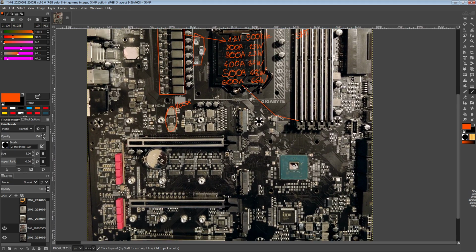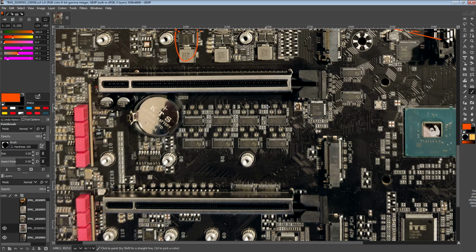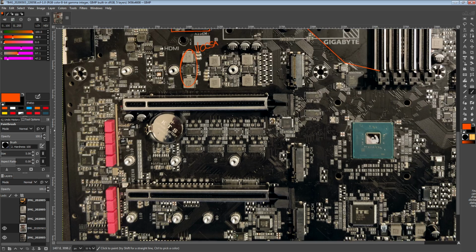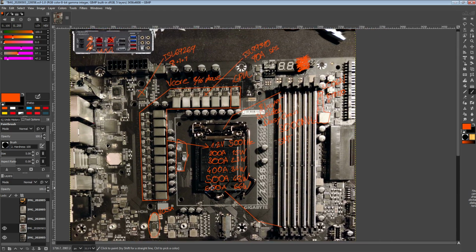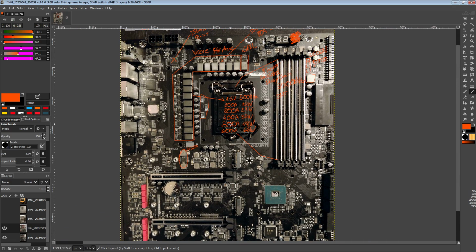But yeah, other than that, I guess Gigabyte would want me to mention that they're using PCIe 4.0 compatible switches and a PCIe 4.0 clock gen. The reason this uses the PCIe 4.0 low loss substrate is that they've designed the motherboard for PCIe 4.0 support once the 11th gen CPUs come out. But 10th gen doesn't support PCIe 4.0 at all, so it's not really a useful feature as of right now, but still a really, really cool board.